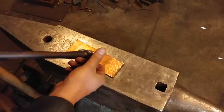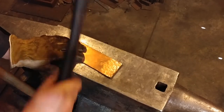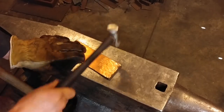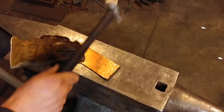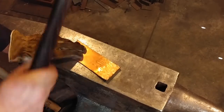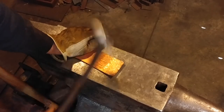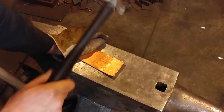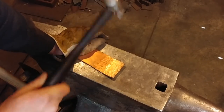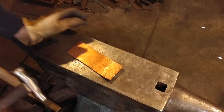As you can see with copper, there's no deformation — this is really all that was needed. On the forging side of things, I do not believe stainless steel should ever be worked by hand. I had a terrible time forging the stainless steel hammer head by hand without a striker — it really resists impact very, very well and does not like to move. It does make a decent hammer though. You want your hammer to be tough, not hard and brittle, and if you have to redress it from time to time after a miss, it's no big deal.